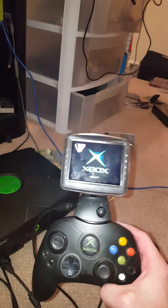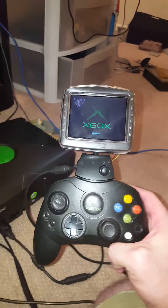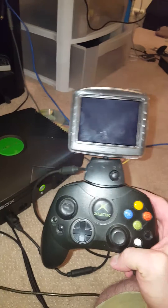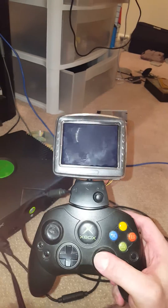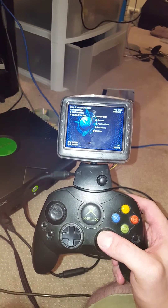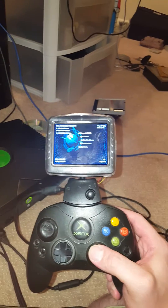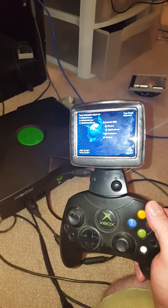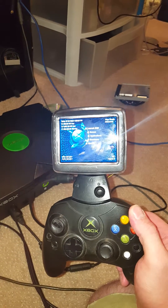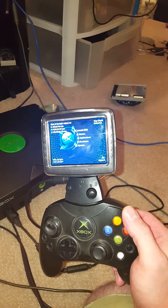There's no sound yet. Basically, the controller can only do 500 milliamps, or half an amp, at full force — I can't do any more than that. The controller draws a couple hundred milliamps and the screen draws 300, so we're totally maxed out. That's why there's no audio.